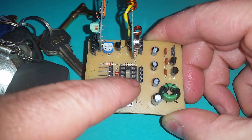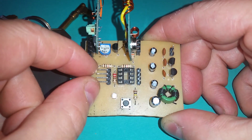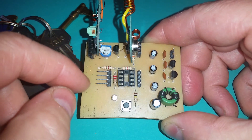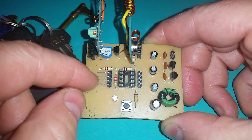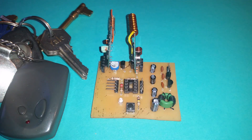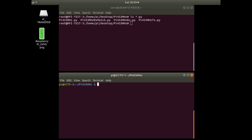The 5 volts runs the receiver. There's a socket for a PIC microcontroller for future use, and a header to connect out to a Raspberry Pi with a ground pin, a receive pin, and a transmit pin — transmitting and receiving on a single wire. I'm connected to two Raspberry Pis: the top one will transmit a message and the bottom one will receive it.